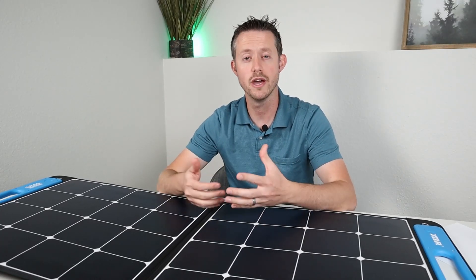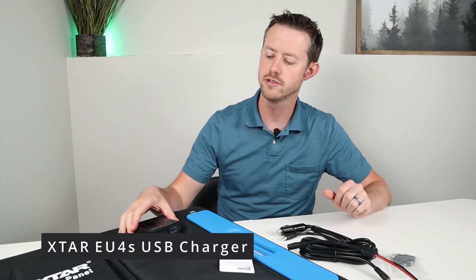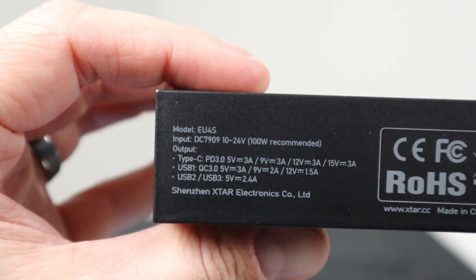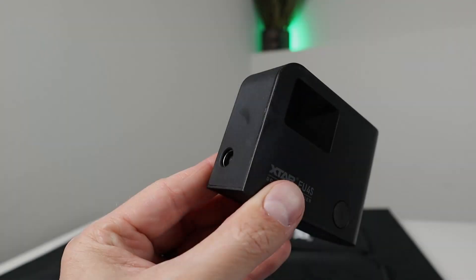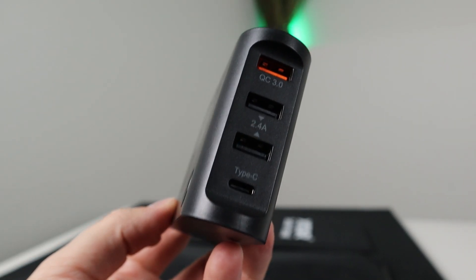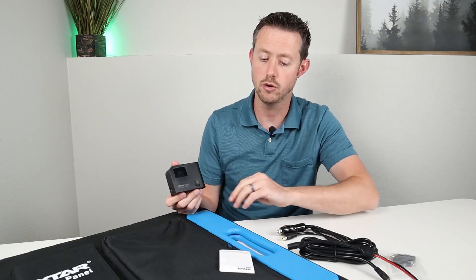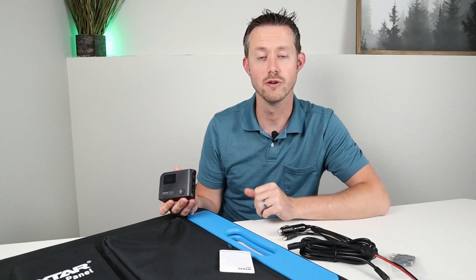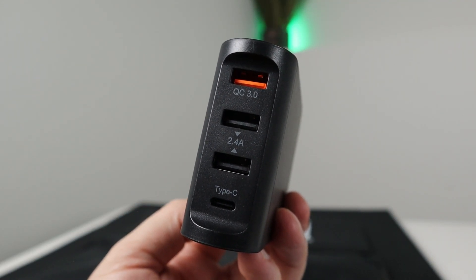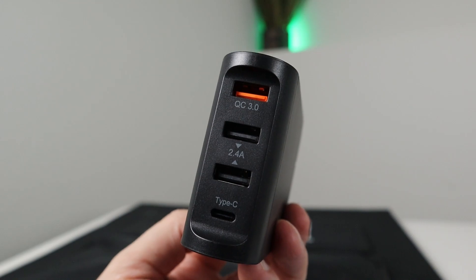If you want to see the most power into your power station or battery, I definitely recommend the X-Star SP100. X-Star also sent out this brand new DC to DC USB charger — the EU4S. It has an input range of 10 to 24 volts. On one side you have an input port similar to the 8 millimeter, and on the other side you have four USB ports. It has an MPPT controller, so with voltage coming in from a solar panel or 12 volt source, you get four additional USB ports. On the USB side there are three USB-A ports — one Quick Charge 3.0, two at 2.4 amp — plus a USB-C Power Delivery 45 watt output.